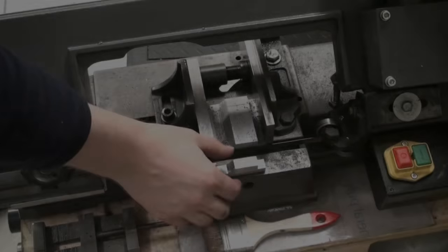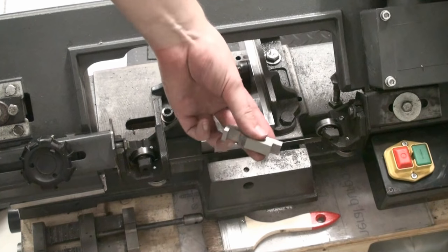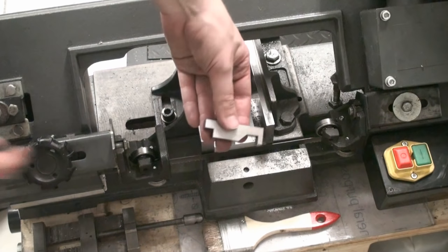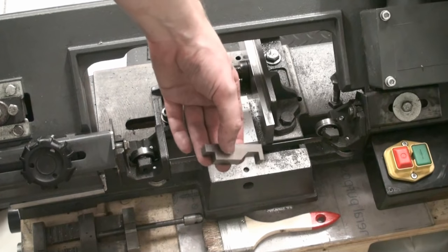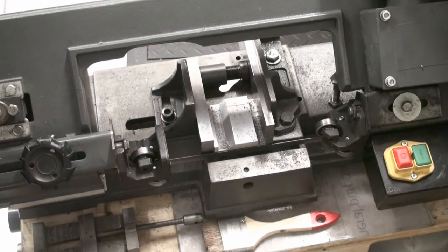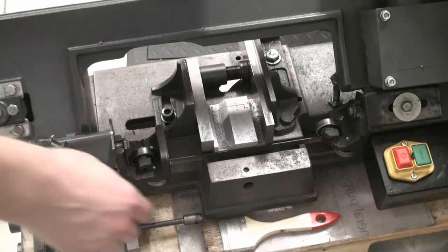So, yeah. Okay, I already cut down the first of the sine bars. Just clamped it in a bandsaw and sliced off a piece. And we only need to mount the rollers. And we have a complete sine bar and machine, of course, the other side. But apart from that, this is a sine bar. Let's cut the next one.